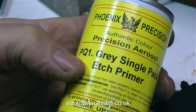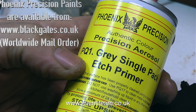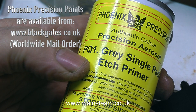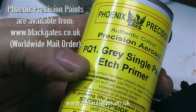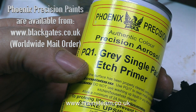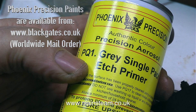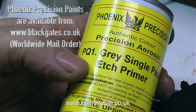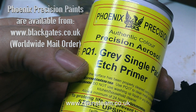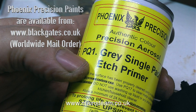To start the painting process I'm going to use some etch primer — Phoenix Precision Paints etch primer, which I buy from my friends at Black Gates Engineering. It's really good stuff; it etches its way into metal parts so that the paint actually sticks. I've roughened the aluminium so I've got a good key. I've had enough now — it is really cold in my workshop today. I'm going to go into the studio and sit in front of my nice video editor right next to the radiator. But first I'm going to shake the tin to mix the paint, just like it says in the instructions. I ask myself if I'm shaking the tin or just shivering. That's it for now — thanks for watching and I hope you found it useful.